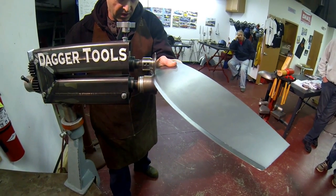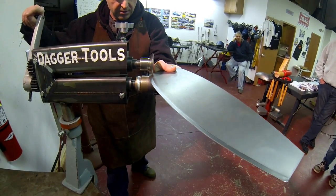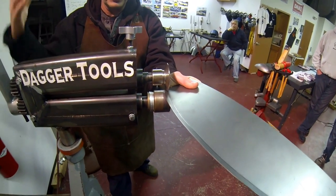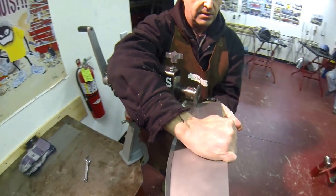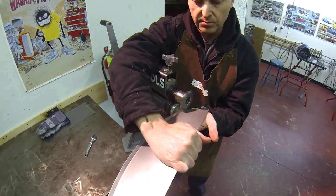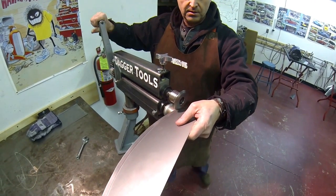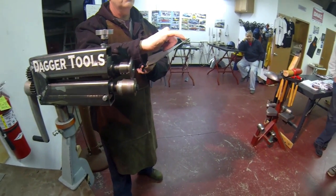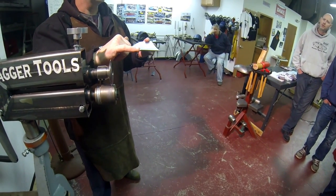You can see there's not really much jerking action going on, as long as you get your full stroke and the equipment set before you start. That's my third hand — I grab the sheet, put my palm as close to the die as possible, and give it a nice tight kick up and finish. It should be as crisp when I started and crisp when I finish.